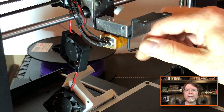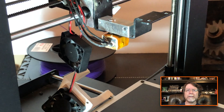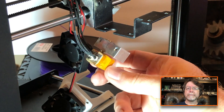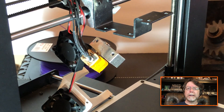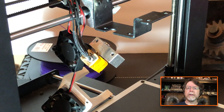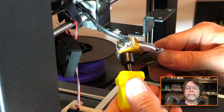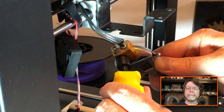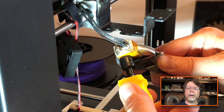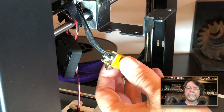You'll notice that we've left the filament in place — I did this for a reason and I'll show you why in just a moment. If it's removed we can slide this whole assembly off. Now we need to remove the cooling block from the assembly, so we'll need to loosen the set screw that holds the block to the tube. With that loosened we should be able to lift the block right off the tube.